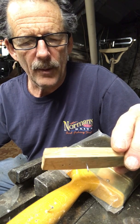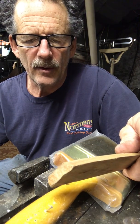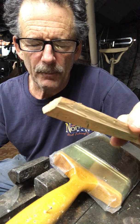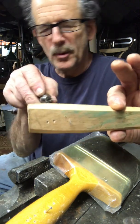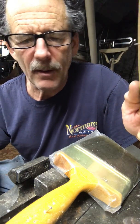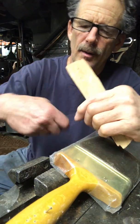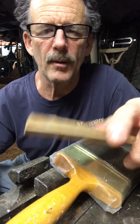You can play around with the nail holes that are in there, but this just makes things easier. It may be more difficult to find places that there aren't holes already in the wood. But there's nothing you can mess up that you can't fix — that's what they make toothpicks for. If you have a problem, you tap the toothpick in, break it off, and you can actually drill right into the toothpick and make your next hole.